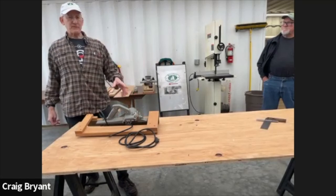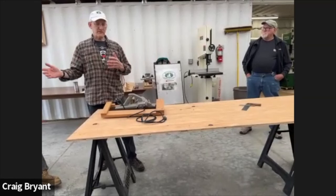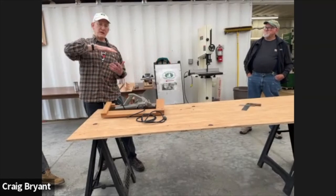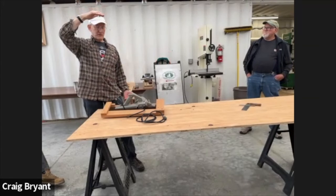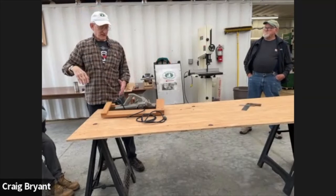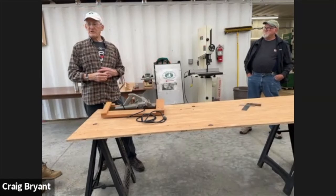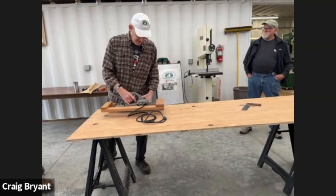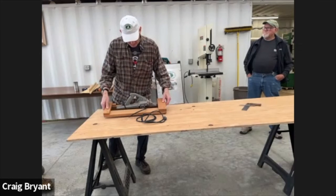This wasn't for planks, just the bottom sheets. I had to scarf multiple bottom sheets. Since the planks on the skiff that I built were basically one piece of plywood, in theory you could have scarfed it together, but since I was working mostly by myself, I decided I didn't want to try to put a scarfed piece of plywood on the boat while it's curving. So I ended up blocking it, but I did use it for all the bottom planking. So that's it. It works pretty nicely.